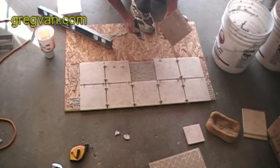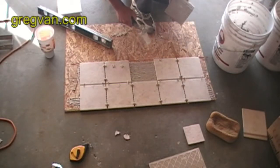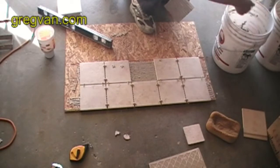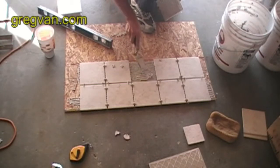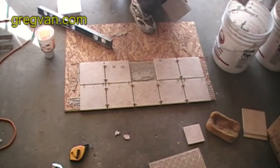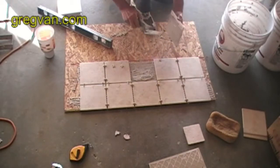That's how fast this stuff will dry. Dry tile, dry wood or concrete just sucks the moisture out of this thing. So just get into your bucket, put some more thinset on, smear it around — this is where this trowel works good. You don't want to leave an area that's not going to get filled in, otherwise you're going to have an air pocket underneath the tile.